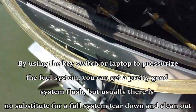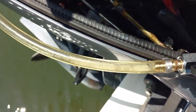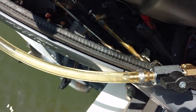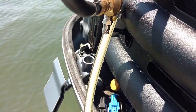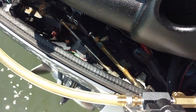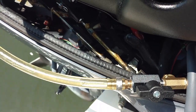I've got fresh fuel again in the VST and I'm just using my computer to help me push this fuel out and try to flush fresh fuel in so I can get this motor to light up again. Because at this point it ain't running. When I pulled the spark plugs out they were all wet — definitely had water getting pushed in by the injectors. Go ahead and get the pump moving. You can see that doesn't resemble good clean gas at all. We might start getting some before terribly long — it's looking better now. The whole point of flushing this stuff out is we don't want to try to put any more of that through the fuel injectors than we have to.